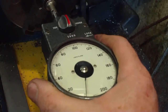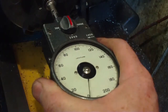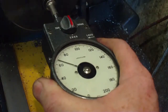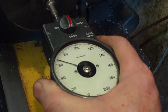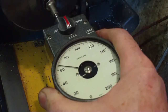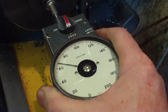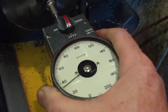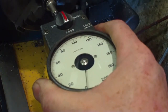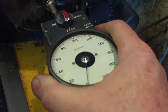We're a bit closer to the lathe now and you might be able to see the meter better. Crank it up — as you can see it's just over six, showing me around about 650. My chart says 630, but it's actually rotating at 650.